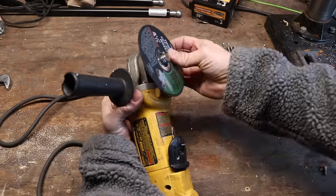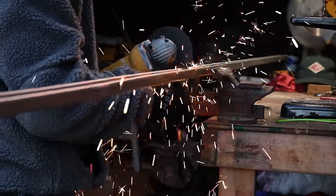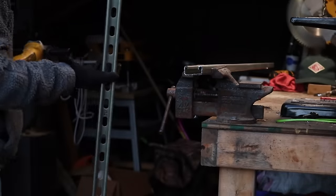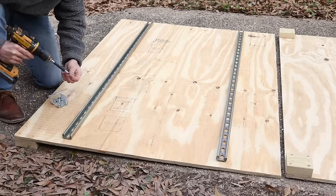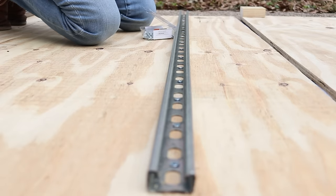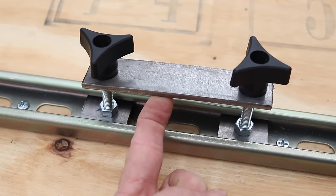Now I'm going to start working on the mounting system so that we can mount the tent to our roof rack. I'll start by cutting the super strut down to size. This is how you're going to attach your tent to your roof rack. So this is the part where you're going to need that 3-foot piece of 3/16 inch flat bar.